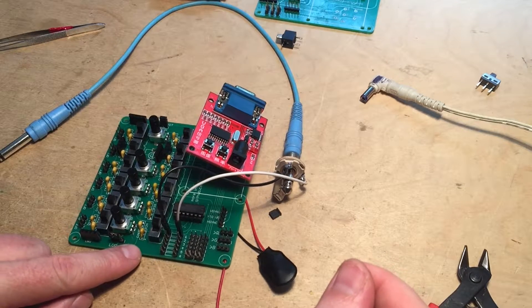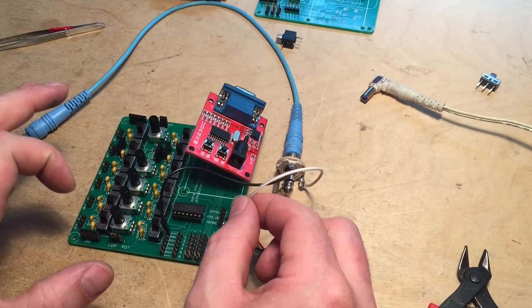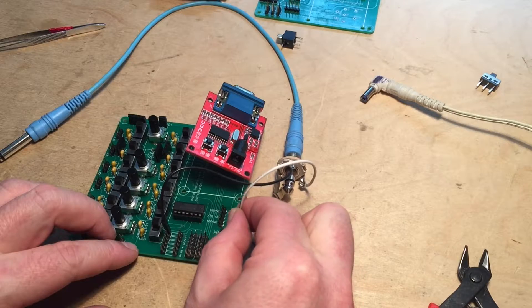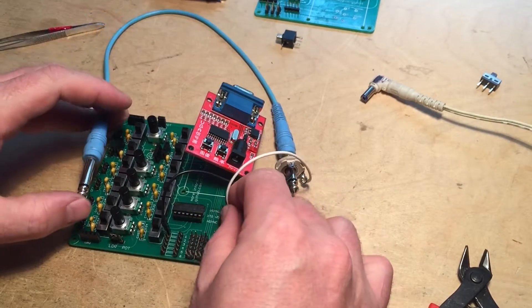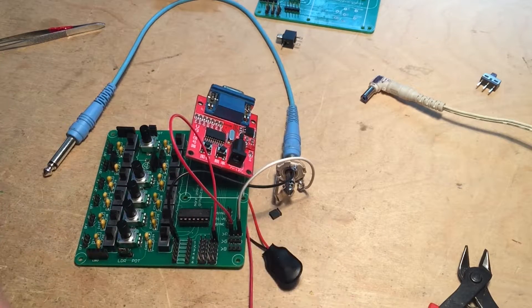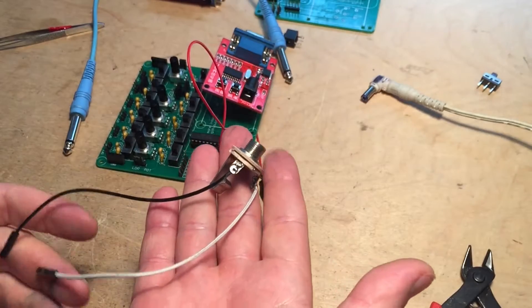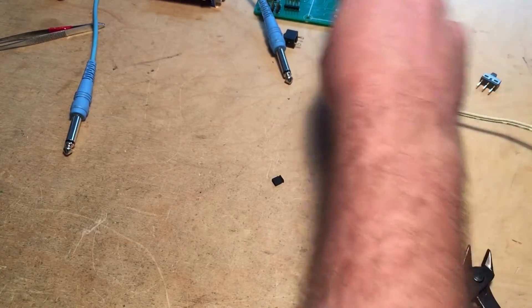You could connect it here and hear whatever is coming out of oscillator one, two, three, four, five, or six — although oscillators four, five, and six will probably be out of audio range since they're very high frequency. Another thing you could do is connect your lead to red, green, or blue and feed audio in — it would have to be loud, but you can make colors by feeding audio into red, green, or blue. You could also take an oscillator out — like oscillator one connected to red — and hear it and see what it does with the video.